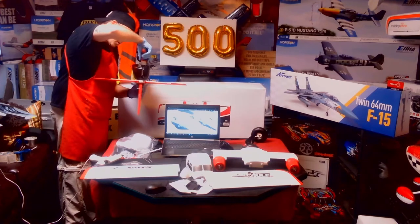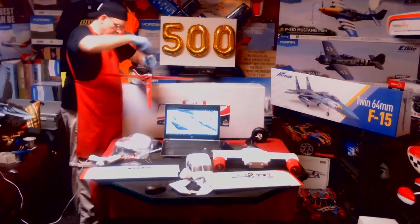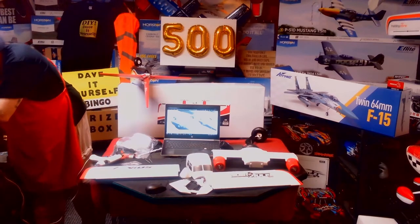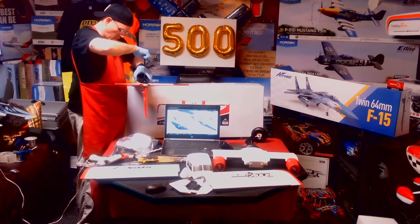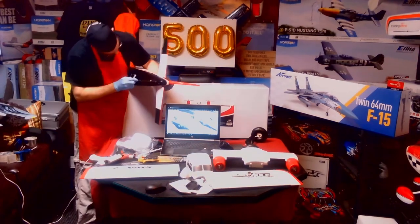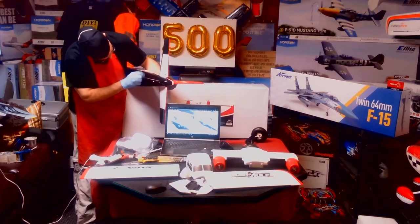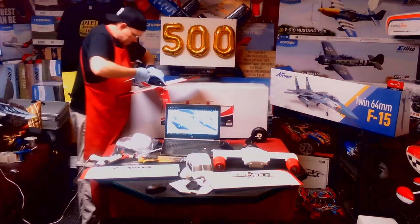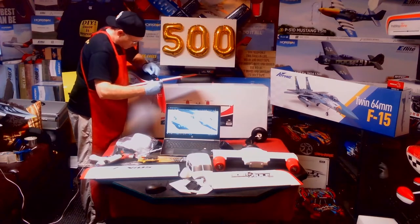And I even have it stuck in a hole. I didn't get any glue in that hole, so that's not it. That is just really weird. All right, let me take a look, maybe the bit on that is just too big. Let me try something like this. Yeah, it's definitely encountering some sort of resistance, but it's really weird. Okay, well, the screw is certainly spinning. It's not like I ripped the face off the head or anything, but it just doesn't want to seat. All right, AVIOS, come on, man. This thing even has a self-tapping head on it, so what the what? Let's try this again.